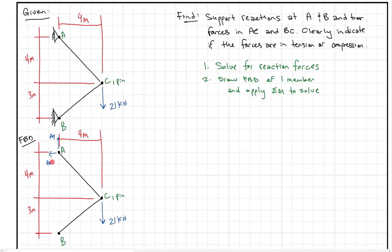We're also going to have something pushing up on B, which we'll call BY, and BX. So we've got all our forces identified. In addition to the free body diagram, I like to include a positive sign convention so we know what positive is when we sum moments and sum forces.